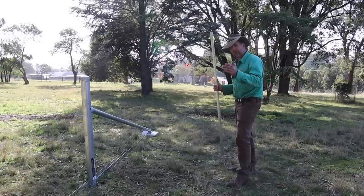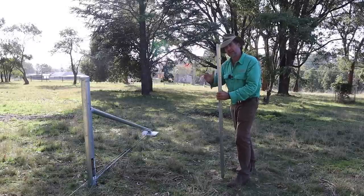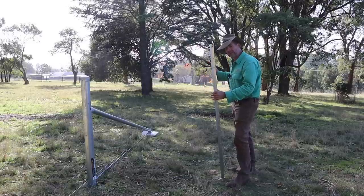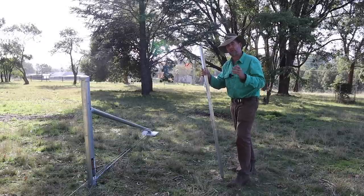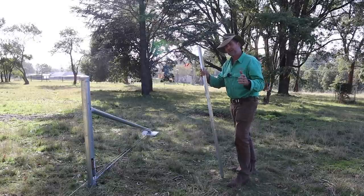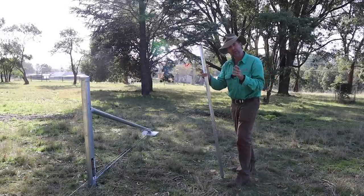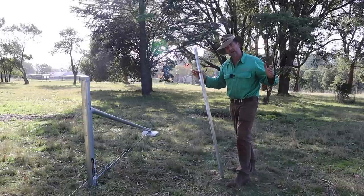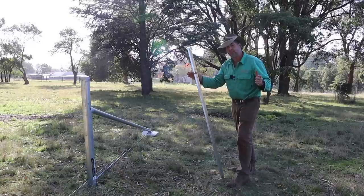Now we've got our two end assemblies in place, it's time to put our intermediate steel posts into position along the line. This process will also work for timber posts, but naturally you'll be auguring holes as well. In this case we're going to put the steels at a four-metre spacing. Some people like three metres, some four, some five, and some even go to seven over in the vast expanses of Western Australia. The basic rule of thumb is to look at your terrain — if it's really steep and hilly with lots of gullies and dips, bring your post spacing in closer together and your fence will look more natural. If you've got large flat expanses of ground, spread your posts out further, save money, and your fence will perform and look fine.